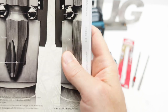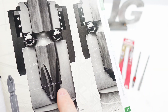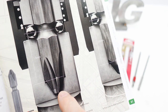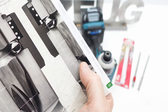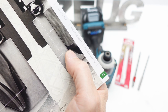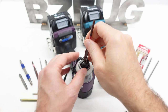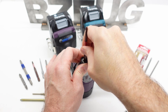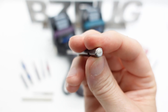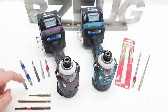This is the Vessel General Catalog — I'm on page 61. They have a diagram of a chuck more like their industrial air tool. You can see the 13 millimeter offset from the BB to this boss, this flat part, and then there's an additional three millimeters that the tip of a double-ended bit fits down into. This partial diagram shows the bottom flat end of a non-double-ended Japanese bit going down into and fitting into a taper. I took a little bit of clay, put it on the end of a bit, and put it inside the Japanese chuck to confirm my suspicion — that taper is not fitting into the tapered bowl at the bottom of the chuck. Clay confirms that the Japanese bits with the 13 millimeter anvil rest flat on that surface and don't go down into the bowled-out part like the double-ended bits do.